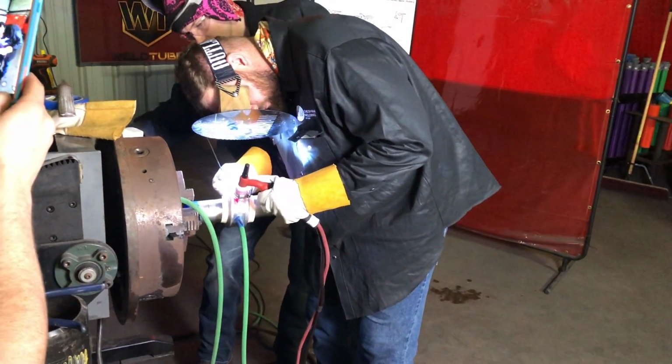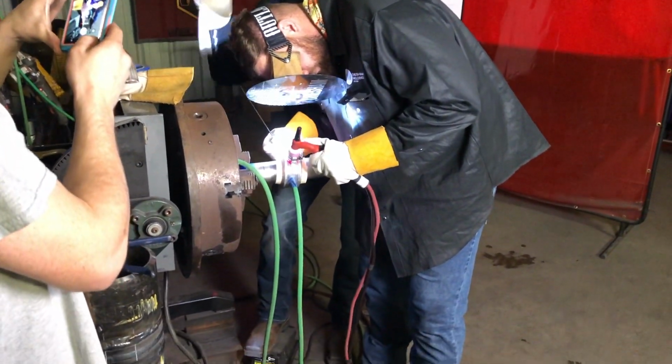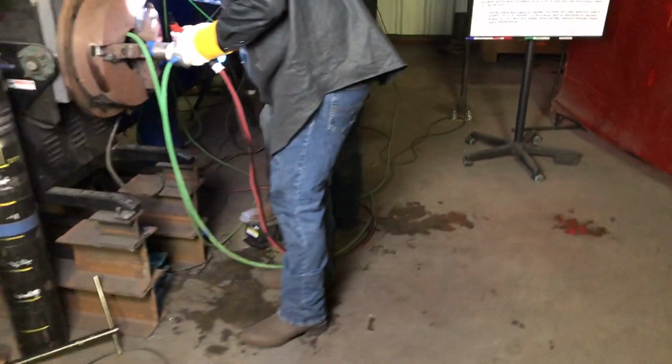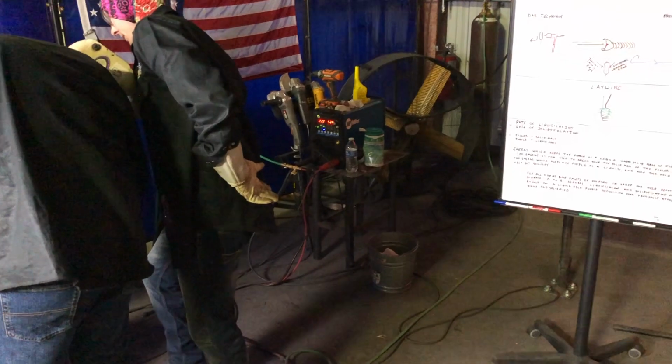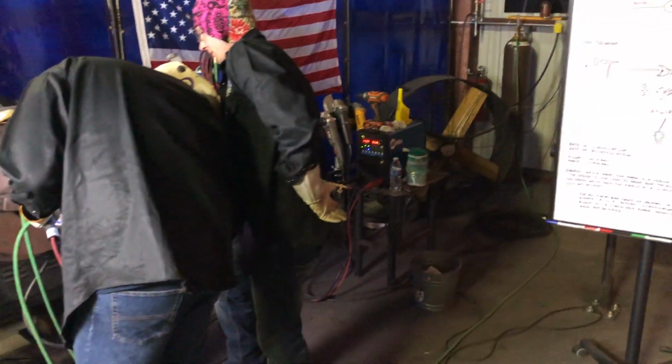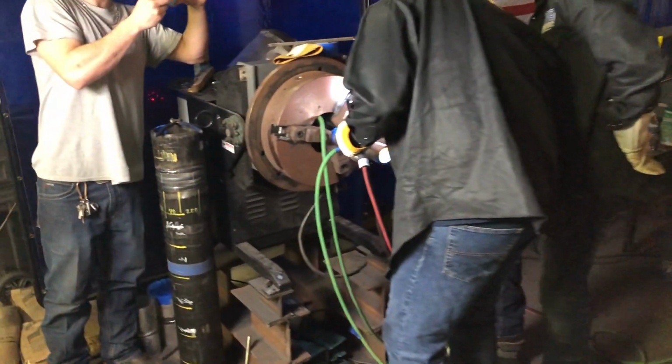When I was at South Coast Welding Academy in Houston, I got the opportunity to TIG weld some titanium pipe, 2-inch schedule 80. So here's the setup: heavy hitter 350 torch, gas valve in the torch. You see the machine there running off a Miller Dynasty 210DX, and then with trail shield and everything.